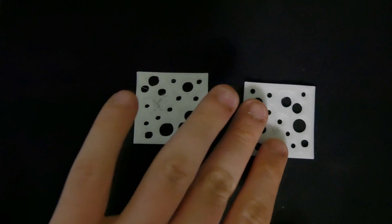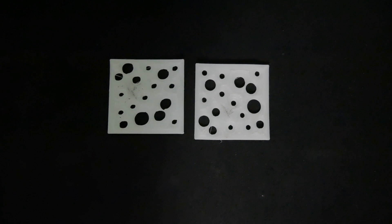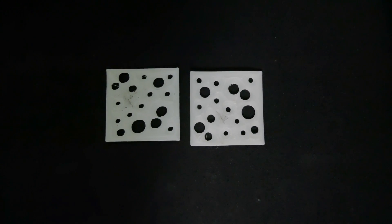Let's talk about a pretty big problem I experienced with the Ender 3. When I was printing something with circles in it, I noticed the circles were actually distorted — not really round at all, more oval and deformed. I had no idea what was causing this. I didn't know if it was build plate adhesion, problems with the model, or plastic shrinking. So I printed a simple cheese-slice-looking test that showed me the circles were all deformed in a similar fashion. I found out the problem was lying in the x-axis timing belt.